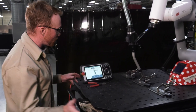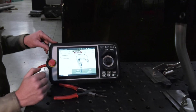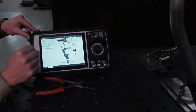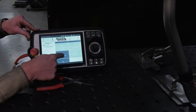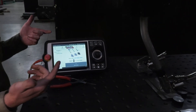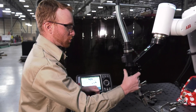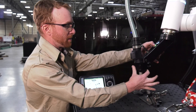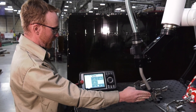Now it's super simple to do. First thing we're going to do is say start here, because this is where we want to start the robot. From here we're just going to click add here and there's an option towards the bottom to add pattern start. We're going to move the torch to the start location, press the green button, and boom — that's our pattern start location set.